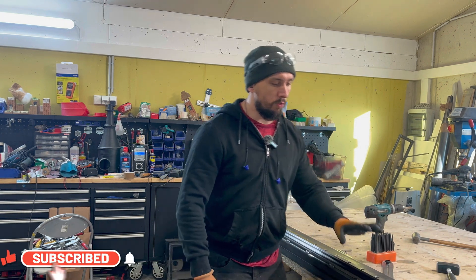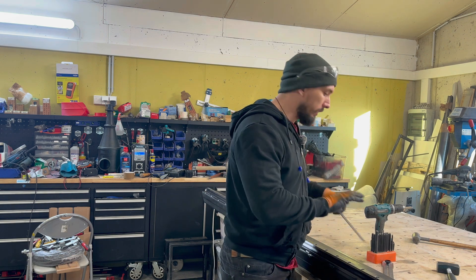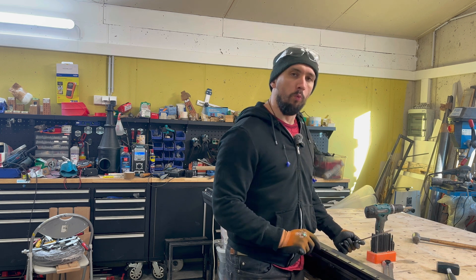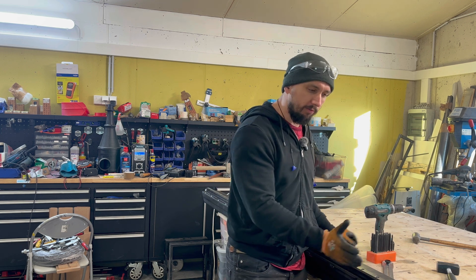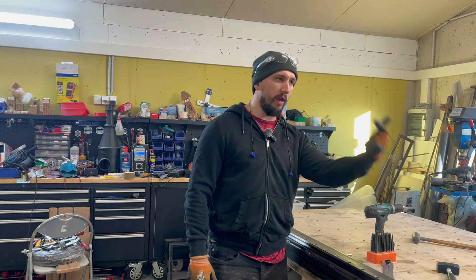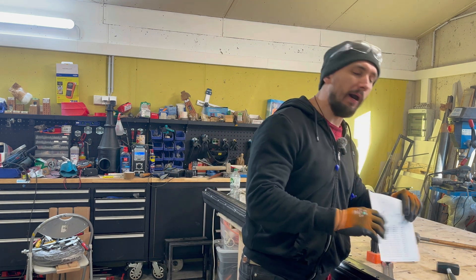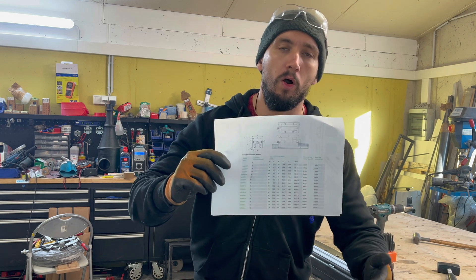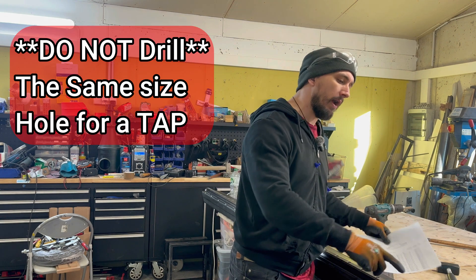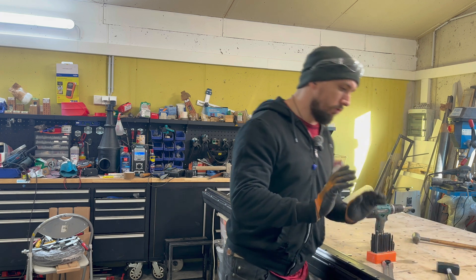We've got the HGH-30 linear rails here — they're big bad boys. You're going to need a depth gauge setter, or maybe an aluminum block where you cut it out and set your perfect distance when you build your machine. I have a punch set, a hammer, a drill, some drill bits, and a tap for these particular rails. Wherever you buy your rails from online, they should all be standard — just follow the chart for what hole size to drill before you tap. Because if you just tap the M8 and put an 8 in, you're not going to have any threads there.